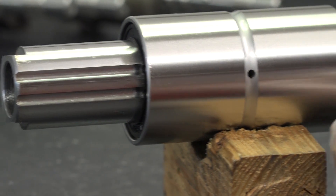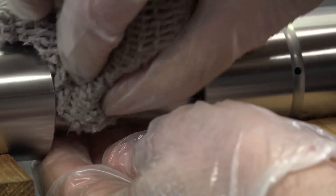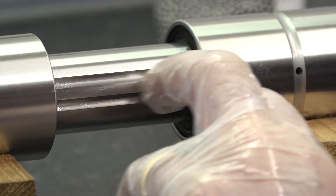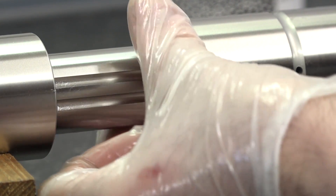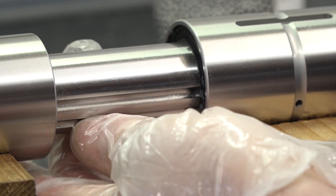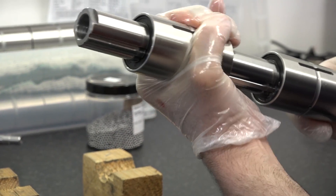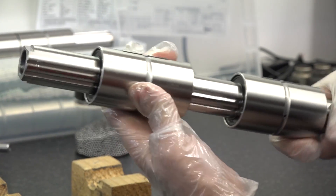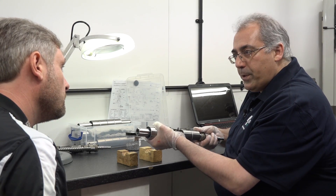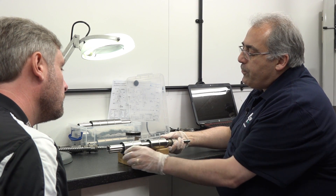The next stage we are at at the moment is to get away with a groove spline. We are in the process of designing our own spline system — what we call a grooveless spline. You will have the ability of a spline that is resistant against torque, bending moments, or radial movements, but with no groove. This is particularly interesting for the food industry.